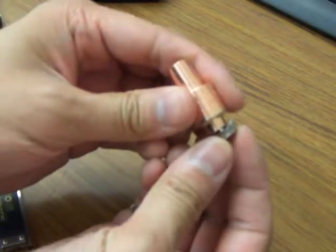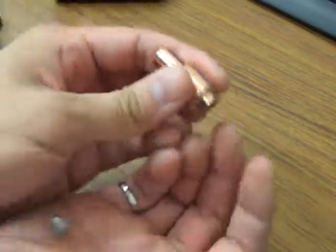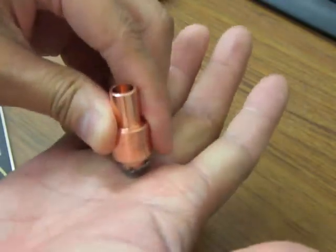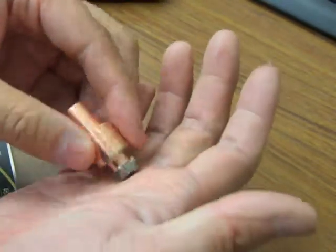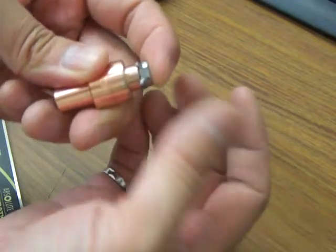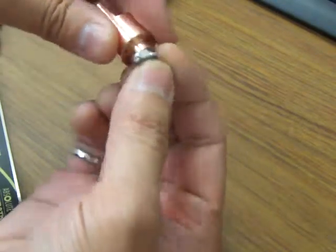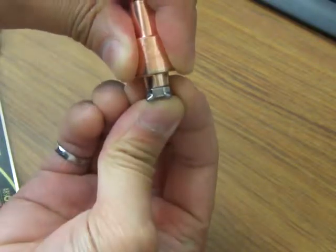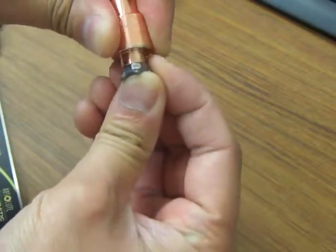In the end, you'll have the same thing with this one. Basically, with this design of the electrode, if the nut is upside down the height will be wrong, and so you can design your system to shut off if the nut is upside down and the height is improper. When the nut is right side up, it will be taller and you can go ahead with your weld.